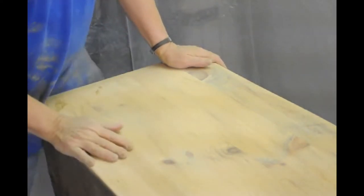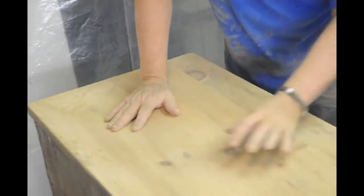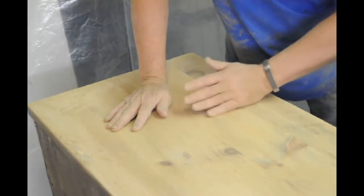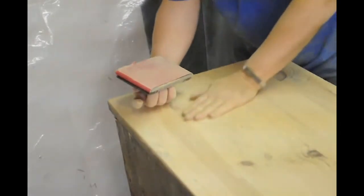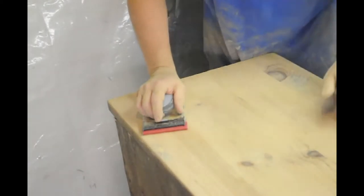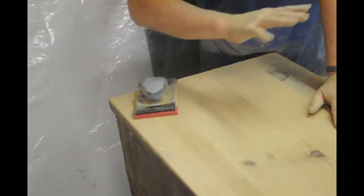I have finished my first layer of sanding with 80-grit sandpaper and taken all of the varnish off the top of the piece of furniture. It's a nice piece of wood with a couple of tiny little blemishes that are pretty much going to disappear once I put on the dark stain and a layer of polyurethane. Now I'm going to take 220-grit, a finer sandpaper, and make it even smoother. The sawdust has a consistency of cornstarch. I think we've sanded enough.